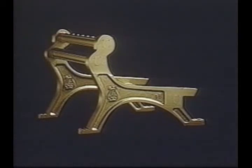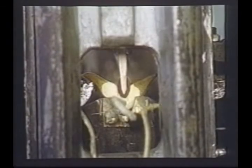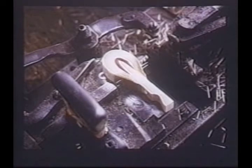The low coefficient of expansion of metal provides the benefit of a stable frame that does not change with variations of temperature and humidity. The hammers for the action assembly are cut from a tapered sheet of felt, a blend of merino and other long staple wool. A set of hammers is placed in a press and the felt forced into shape for gluing to hammer moldings. All Steinway hammers are made in the Steinway factory and are drilled and compression wired for stability. This provides fuller, richer tone.